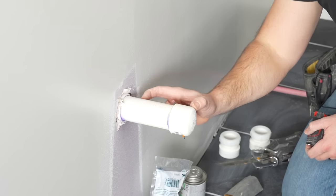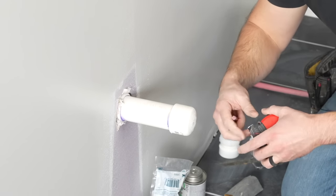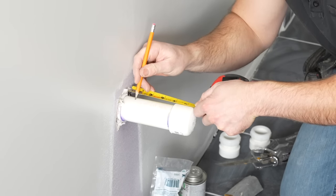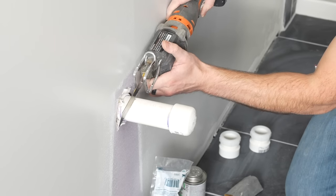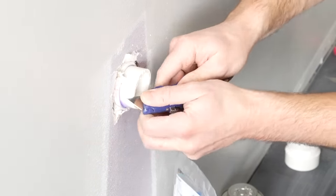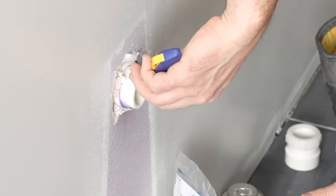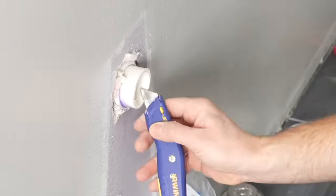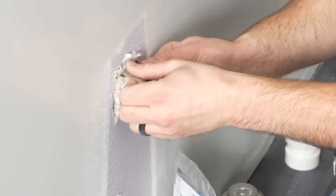I'm now going to cut the drain pipe coming out of the wall. If you need to know how to rough in plumbing for a bathroom, check out the video card in the top right corner. I'm measuring about an inch off the back end of the plumbing pipe, then taking the sawzall and cutting square onto the pipe. I then deburr the PVC pipe with a utility knife. You definitely want to hit the inside of the pipe too because hair can get caught on little burrs. I also take sandpaper around the pipe to remove any paint.